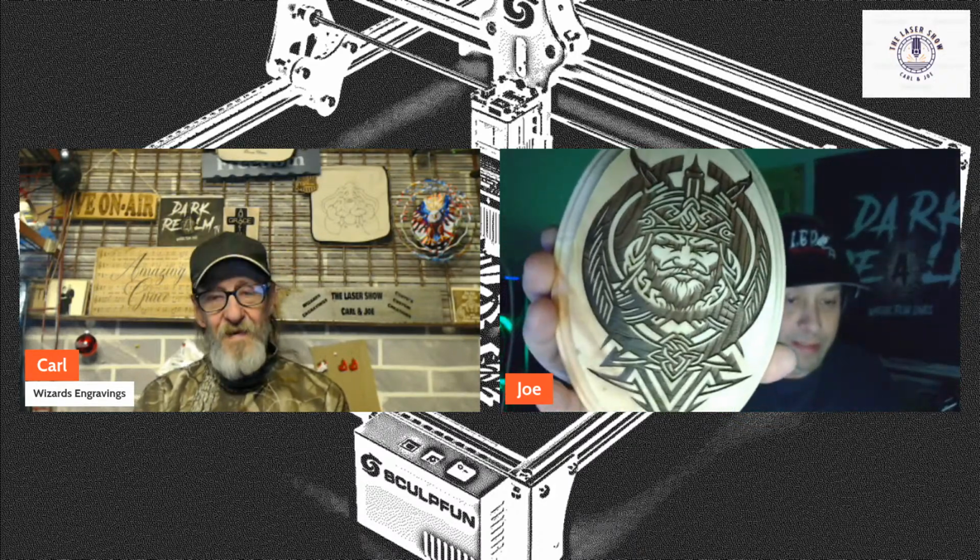Show them that one that you did, that picture that you engraved deep with one pass. The one I just did tonight? Yeah, this is one pass. Now, how much power and speed? Oh man, it was at 2,000 speed and 75% power. I didn't mean to go this deep. I just wanted to test it, and it actually turned out really good. You went about a 16th of an inch deep at least. Yeah. And I can cut cardboard.